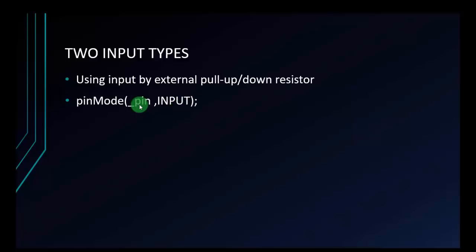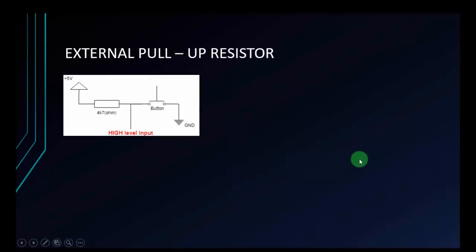The first parameter is the Arduino pin which I want to receive the input signal, and the second sets that pin as input with an external resistor. In this diagram, I will connect VCC with 5 volts. The resistor here is 4700 ohms. VCC connects to one pin of the resistor, the other pin of the resistor connects to one pin of the button, and the other pin of the button connects to ground GND. The branch here connects to the input of Arduino.